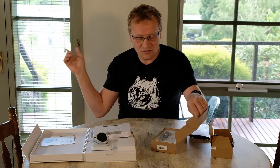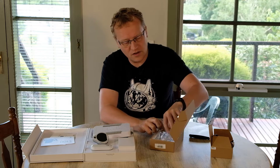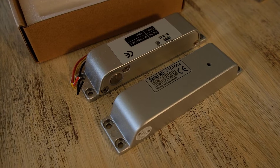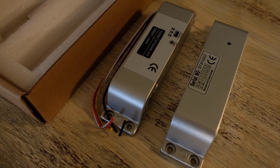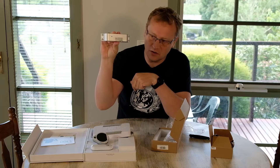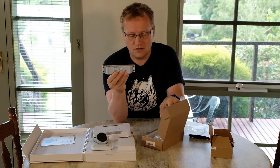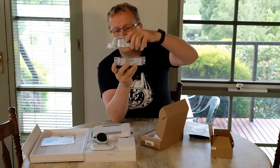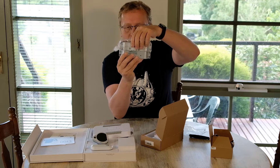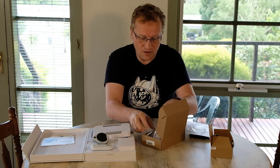This is kind of an old door from the woolshed that my office is in, so I've bought a magnetic lock that goes on the top of the door. The top bit goes outside the door frame, and then there's a plate that goes on the other side of the door with a little pin that locks it. I'm first going to set up a test rig to make sure everything works together before I install it.